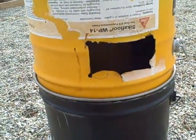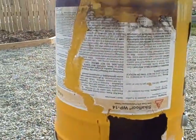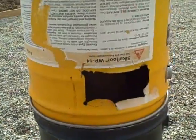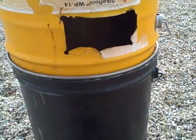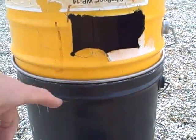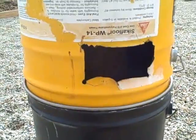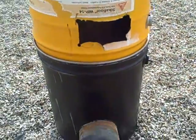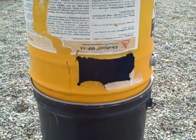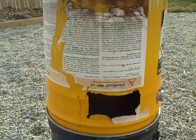It's not really required to put a top on it, but it gives you a different idea if you want to cook on it or heat water — and it will for sure do that. The size of the hole in the top should ideally be bigger than the chimney tube so there's no restriction. Once again, I just kind of eyeballed mine and didn't do any math — it probably needs to be a little bigger, but I just put this together with two free cans to see what I could do. It seems to work pretty well and it's a fun concept project to build, so maybe you can steal some ideas from this.